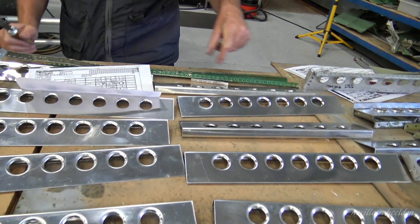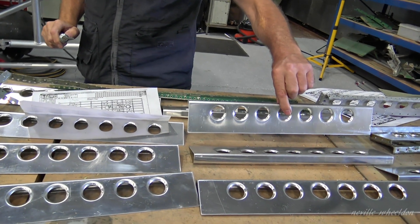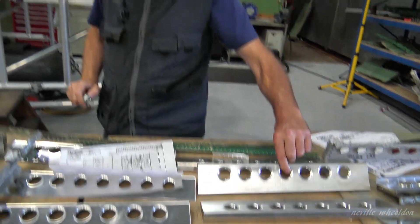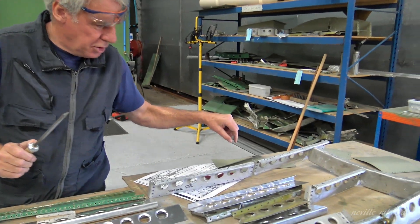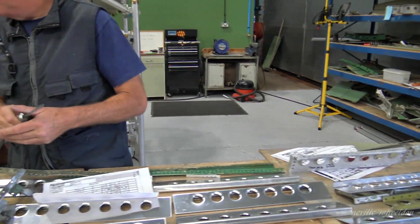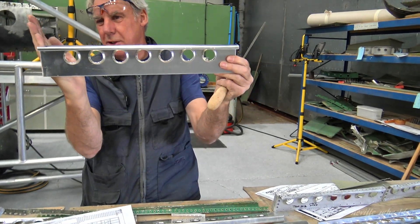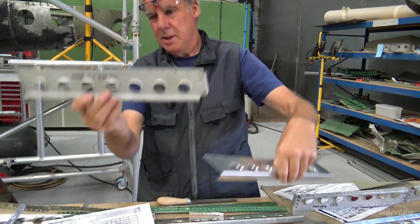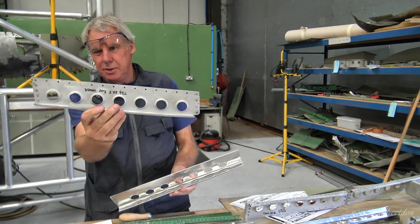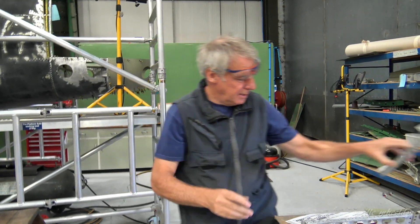Have you made these in the house? Keith has made these — yeah, he's doing the fin tip, made them. So these are at the moment just fresh plates, and each one now John's going to have to adjust to fit the floor. They're actually in the floor at that angle, so John's just got to take a bit off the front and the back to get the angle right to make sure they sit correctly. There's a good example — that's an original one there, and you can see it's at the back of the Lancaster at an angle. John's going to have to take that shape and check it to fit.